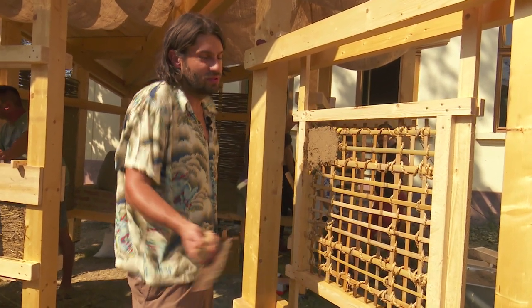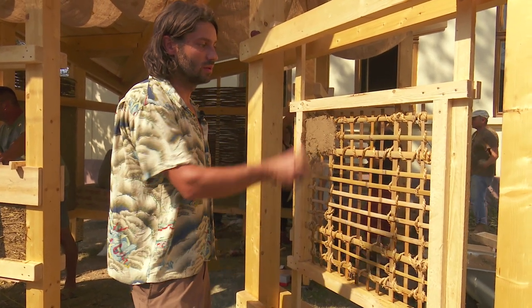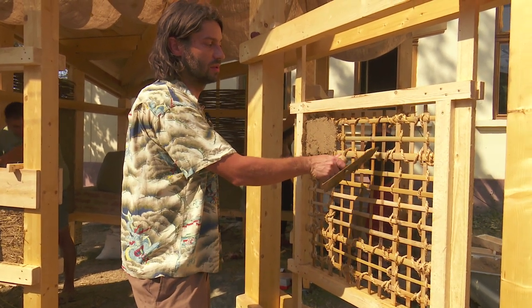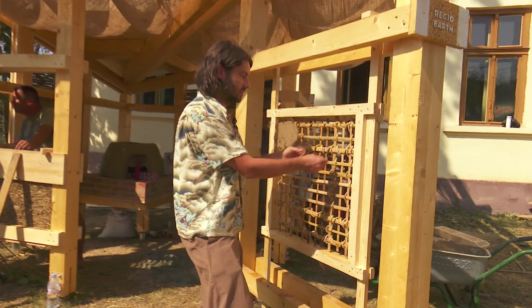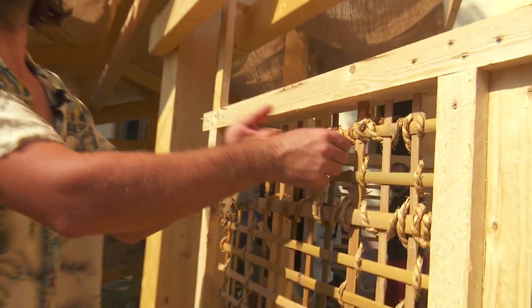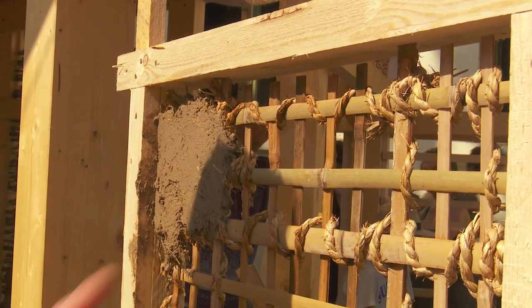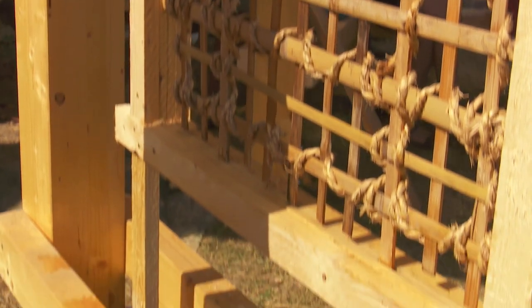Generally, because the main grain Japan produces is rice, all the straw, both in the material and holding together this framework, is made of rice. I don't have the sample here, but what is also good with rice straw is that it's really flexible. You don't have to make it wet, but it's really, really strong. So if it's kept well without moisture, it can stay for like 100 years or 200 years without losing its strength.